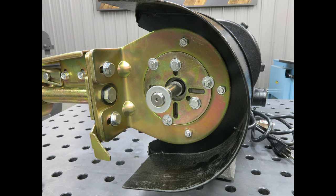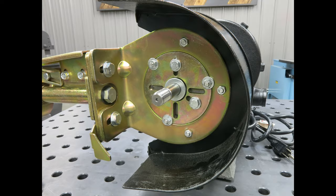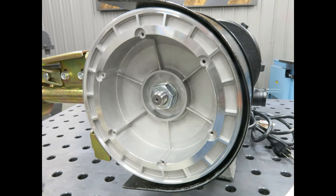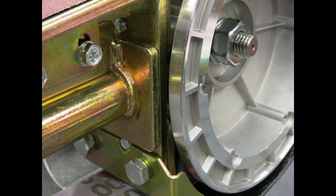Slide the appropriately sized washer onto the grinder shaft. Washers that suit either half or five-eighths inch diameter shafts are provided. If your grinder has a half inch shaft, use the supplied bushing. Slide the drive drum onto the shaft and secure with the remaining washers and the provided nut. If the adapter bolts and plate interfere such that the drum does not turn, place an additional washer onto the shaft before the drum. There should be approximately a quarter inch gap between the edge of the tensioner arm bracket and the lip of the drive drum for starters.